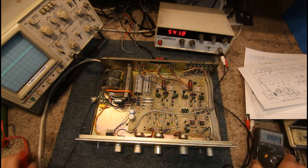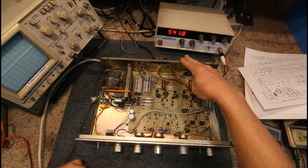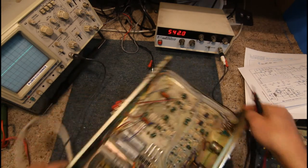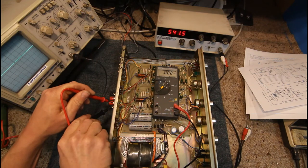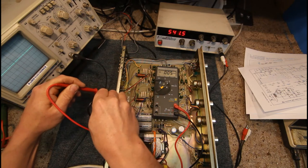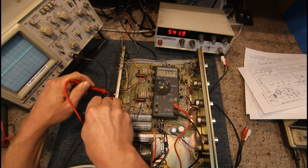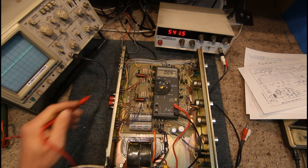So we've got our first basic check — if we've got all that running, we know voltage should be getting through to the preamp section and out to the output stages, the 2N3055 transistors on the back. That still doesn't necessarily mean it works, but at least there should be no short circuits or power open circuits. The next basic check you do with every amplifier before you connect it to any speakers is, on DC volts, go across your speaker terminals — there should be virtually nothing there, maybe a few millivolts.